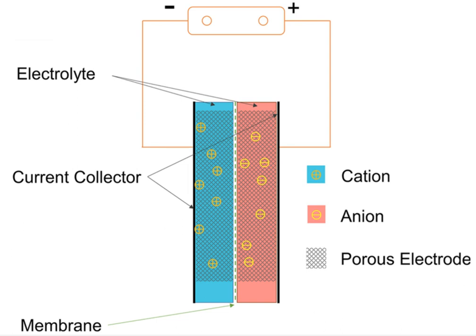It is produced from activated carbon powder pressed into the desired shape, forming a block with a wide distribution of pore sizes. An electrode with a surface area of about 1,000 square meters per gram results in a typical double-layer capacitance of about 10 microfarads per square centimeter and a specific capacitance of 100 F per gram. As of 2010, virtually all commercial supercapacitors use powdered activated carbon made from coconut shells. Coconut shells produce activated carbon with more micropores than does charcoal made from wood.